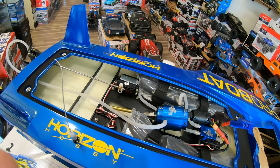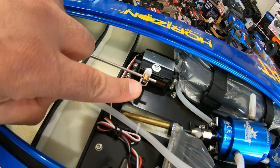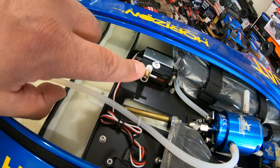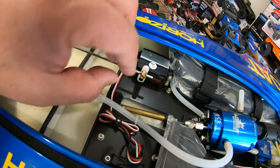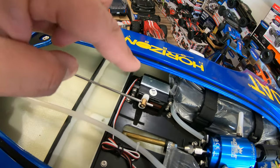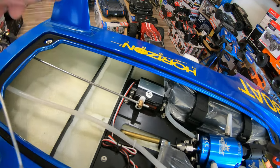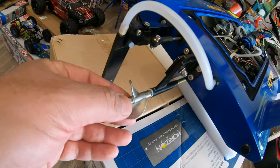A couple of things that are very important for anyone getting this boat: always check that the set screw is closed inside the push rod. Check that the mechanism is set up the right way and is not loose. Also mark exactly where it's supposed to be — put two black dots front and back around it so when you look at it you'll know if it's shifted out of position.